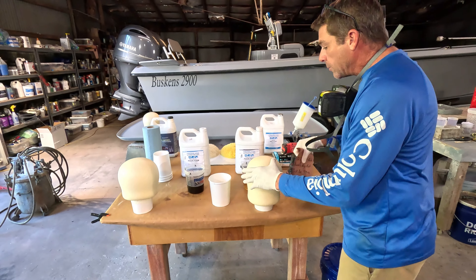You can see, even with these vent holes, we've got some push up on this compartment. There are other ways to do it. When we start tackling our 21-foot project boat — if you go back several episodes, you can see we've got a project boat that's going to need stringers, floor, transom, and foam flotation. Even when we used to build some 19-footers here in the shop, we would pour the foam in between the stringers, trim it down flush, and then actually encapsulate it in fiberglass. I'm going to show you folks how we did that once we get into our project boat.